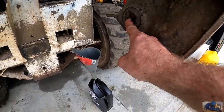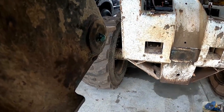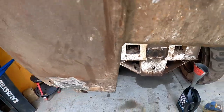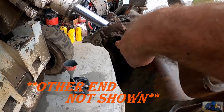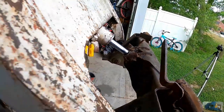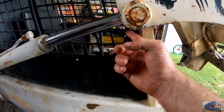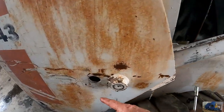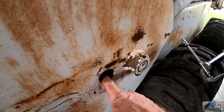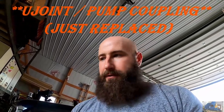The greasers here. We took those out because they wouldn't take any grease and used the nozzle. Have a greaser here, and then the same on this side. You have one on this lift arm down here in this hole, and that should complete all the grease points that I know of.